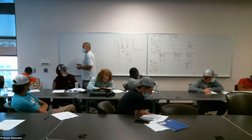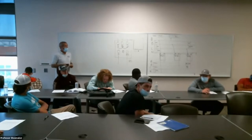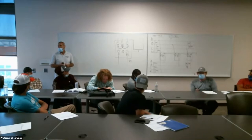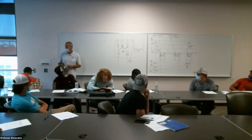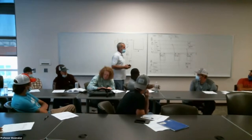All right, so you guys are familiar with closed delta, open delta. Where's my high leg on this bank? Secondary. I think somebody said it right away. What'd you say? There isn't one. There is no high leg.